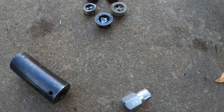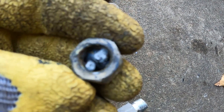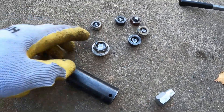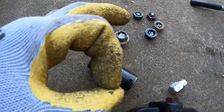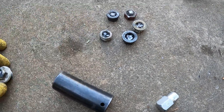These are the nuts I tried to use — smaller nuts compared to the original one I used. What happened is it failed because every time I tried to weld in there, you can see the weld is not as much. Every one of them ended up snapping off because it was not biting that good in there. I gave up on using the small nut because if I have a bigger nut, then it's no problem — I can keep welding and the center will be nice and big.